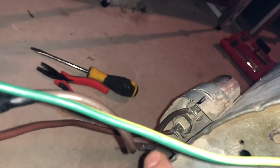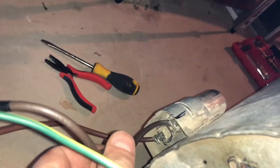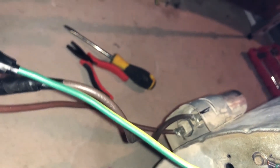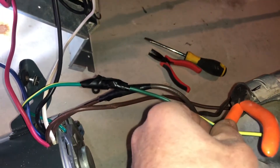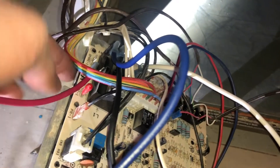One more thing — go over the danger points. Make sure you hook up a ground wire; you've got to have your ground. Do not touch the left and right terminals on the capacitor with any metal objects. When plugging those in, use something with a rubber handle, or wear a rubber glove. Don't go touching everything or you'll get zapped.